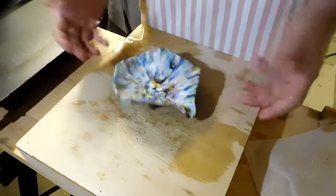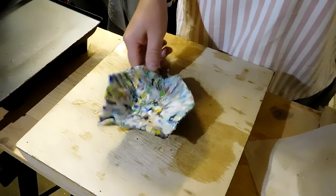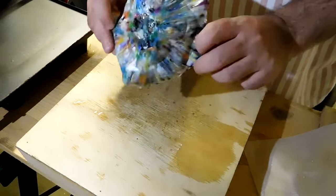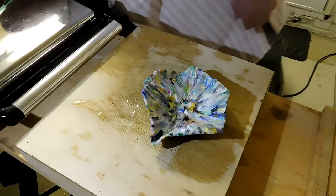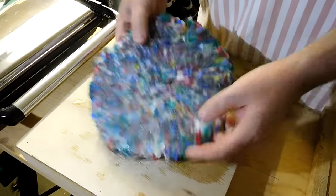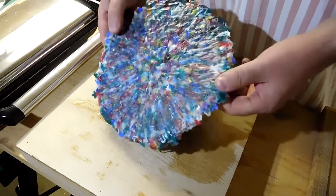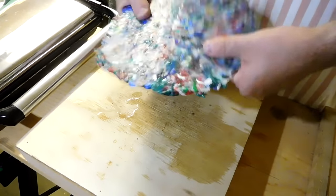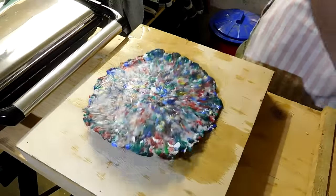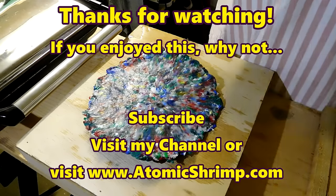I'm a little bit disappointed - I kind of hoped it would just turn into a beautiful little bowl. That's what happens when HDPE cools unevenly - that's why I have to clamp it and go to all sorts of lengths to constrain it while it's cooling. Here's the piece we played with earlier - as you can see it's just completely hopelessly distorted now. There's not really very much I could make out of that unless I really wanted a curved piece of something. That piece is completely rigid now and there's no way of bending it back into shape. I hope that's been useful. There are going to be some more practical HDPE recycling videos coming soon, so if you're interested in that kind of stuff, please think about subscribing. We'll see you next time, thanks for watching.